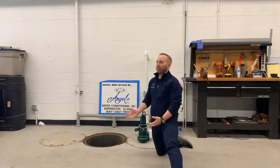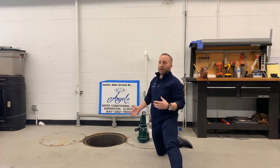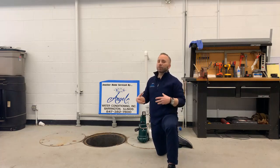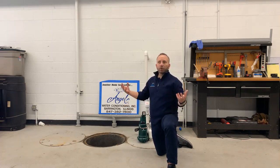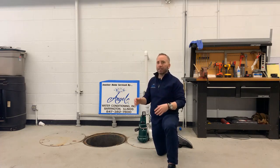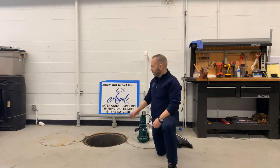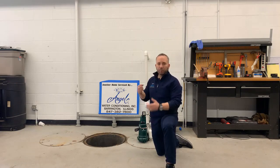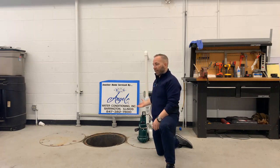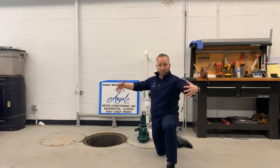It costs about $10 for us to run the test, and sometimes we have to open up the pit to check everything is clean. In new construction, the sump pump pit is often a garbage can — we've had many new homeowners try to file claims against us saying our water softener flooded the basement. When we investigated, the pit had construction debris swept into it: drywall backing and other material that plugged the impeller of the sump pump. The water softener puts 70 gallons down the pit, which usually holds 50–75 gallons depending on size.